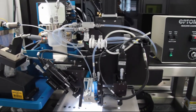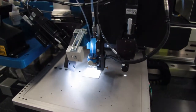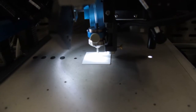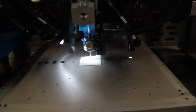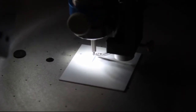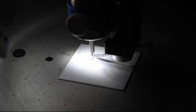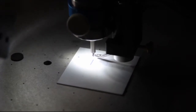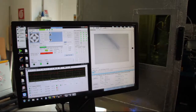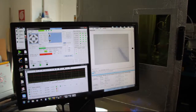Finally, the aerosol is focused in the print head. In this head, the aerosol flow is injected into a transition region where the sheath gas wraps cylindrically around the aerosol flow. These two elements are strongly accelerated when entering the print nozzle, which is a narrow channel with slowly decreasing cross-section. In a properly designed system, the gas flow is laminar and axially symmetric with a small Stokes number for the particles in the transition region, becoming large at the exit of the print nozzle. The sheath gas prevents the droplets from impacting or condensation of the solvents from the aerosol at the inner wall of the nozzle, and guides the aerosol flow.